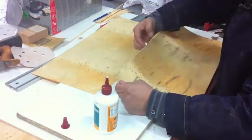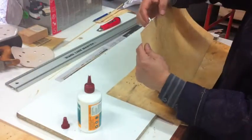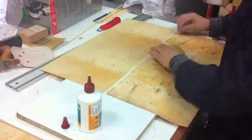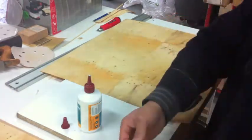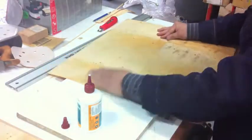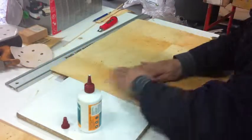Cutting a straight edge on the veneer, lots of light cuts rather than a few heavy cuts. When you do the heavy cuts, the blade will tend to follow the grain of the timber. I then use a bit of PVA to hold the two leaves together for pressing. It's quite simple, bit of PVA on the finger and down the straight edge of the veneer.